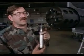Our planes carry 1,150 rounds of this. To give you some idea how long the gun system is: the gun barrels actually end here, and the gun barrels start about here. The gun rotor is in this area. The hydraulic drive mechanism and the two drive motors are here, and the ammunition drum starts about here and extends all the way back to here.